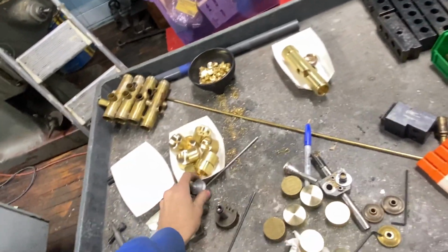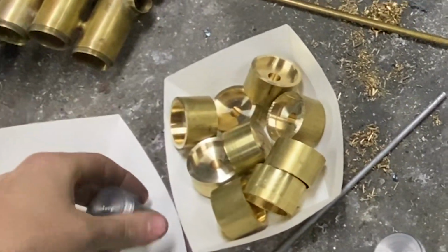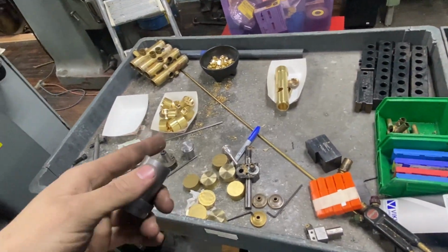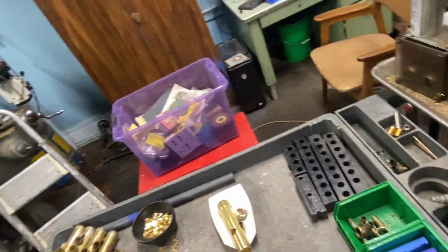And then we have these arbors, so these actually screw into these caps. And then this will go into the spindle. I'm actually probably gonna do it on this machine because this machine can go 100% feed rate. Actually, if I play my cards right, I can be running these OD profile on this machine while I'm running these blanks on this machine. That would be fun. Maybe we'll try and do that.